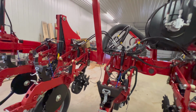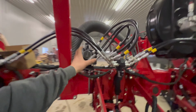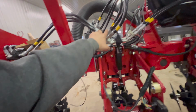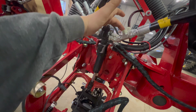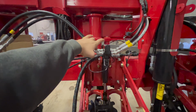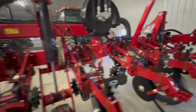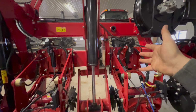So, all right. For the Delta Force, Dad started plumbing it. He's got a lot of the rows done, but you have the control box for the Delta Force. So you're running from the control box into here. This will supply all the units. For these T fittings, there'll be a hose that runs up the frame back into this one here. Then we need to get T fittings for right here yet. Then there'll be another hose that connects to that and runs across to get to this wing here. Obviously you can't join these two because when you fold up, you'll tear your hose.